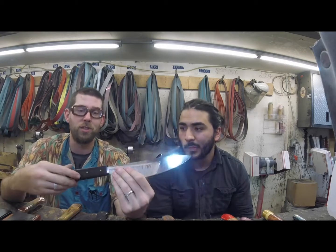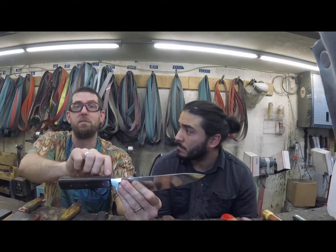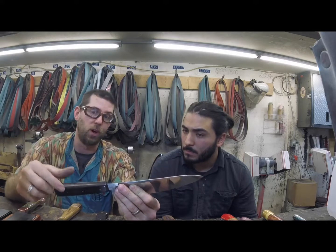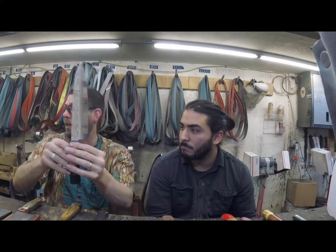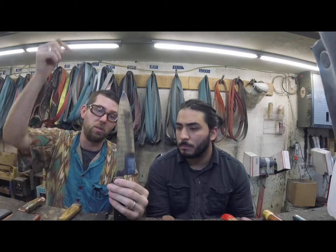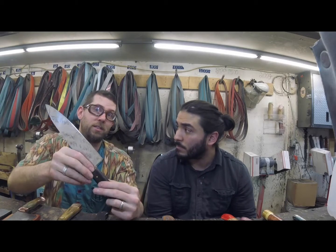There are several ways to do this. You can cut the handle in half and basically mill out or chisel out the area where the tang's going to take up and then glue it all back together, or you can round it out from the center the way we do with an antler, because you're not going to cut that in half, or you can burn it out, which is a multi-step process. Do not do it in stabilized wood. I did that once. I'll never do it again.